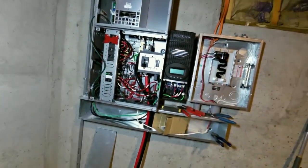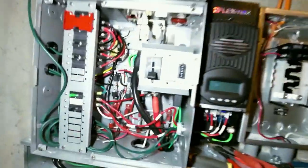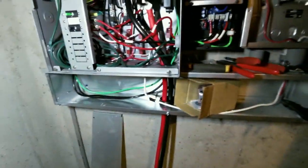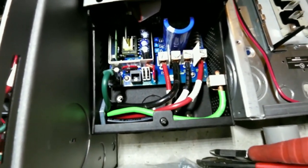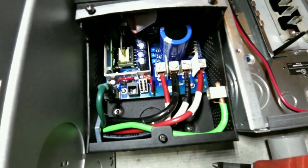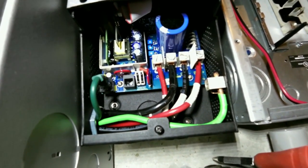This GSLC comes pre-wired. These things are really hard to wire, man — they're so tight, there's so much stuff in there. It's ridiculous. Had to slap a gutter; I only had a rain-tight gutter on the truck so I slapped it on there. There's the inner gut with the FM80 — just about identical to the Midnight Classics. Same guy that designed them, rumor has it, designed these. You've got aux terminals, battery positives, battery negatives, PV positives and PV negatives.